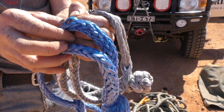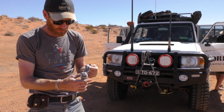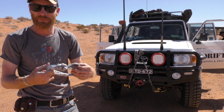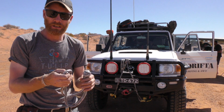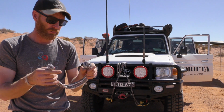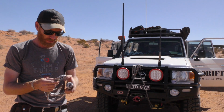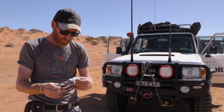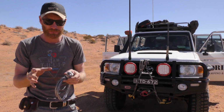So it's coated before. And the Chinese is the same, fully coated yarn before it's woven. With the tie stuff at the moment, they're making a lot of rope for the Toyota Corporation, where they coat the outside only. Now that's got some good and bad points. It's technically stronger if it's coated on the outside only, because the more coating, it does lose a fraction of strength, which is irrelevant in a way, but it's easier to use and softer. So the trick is to get the right percentage of polyurethane coating, and that's what we're tweaking at the moment.